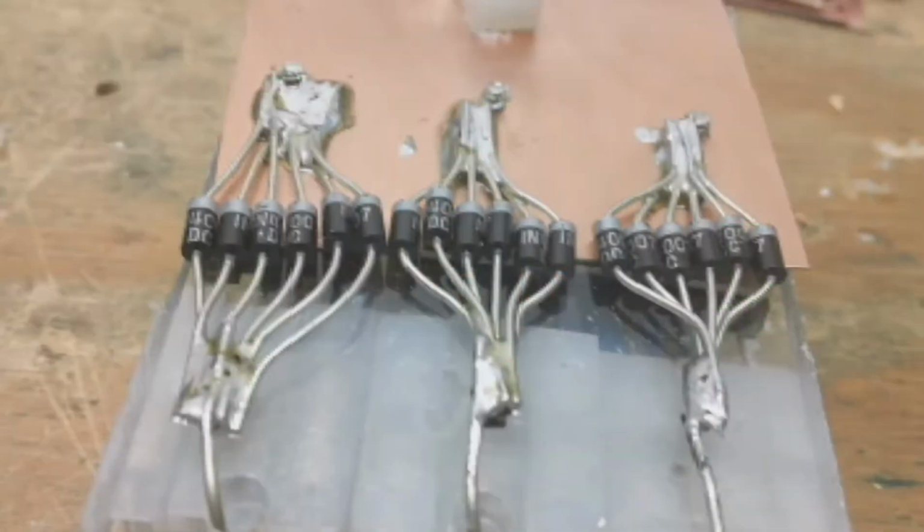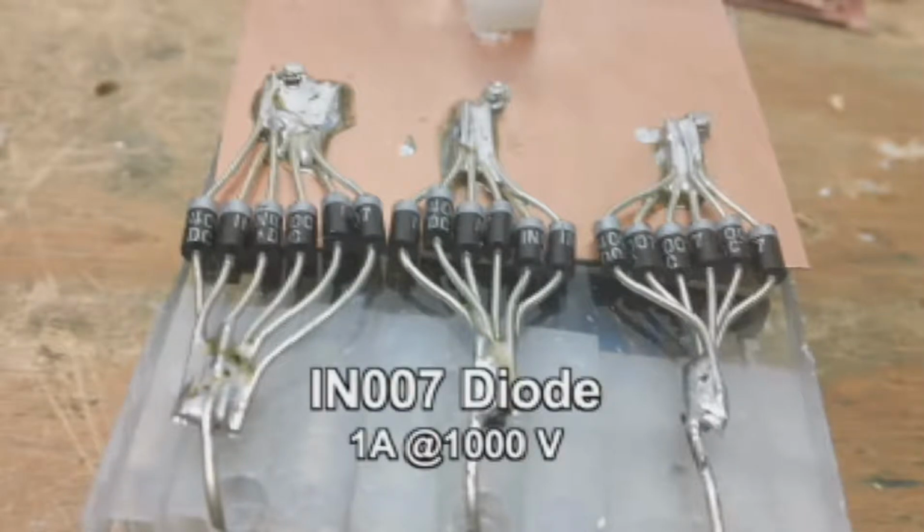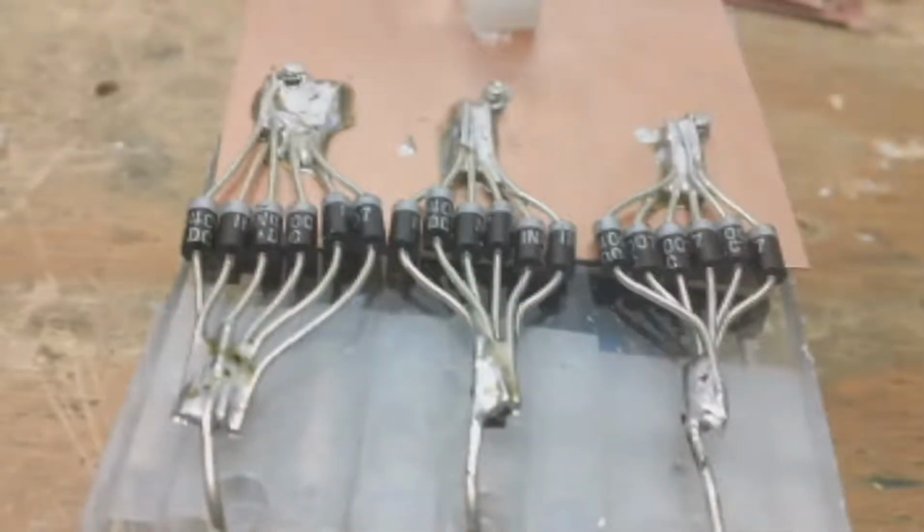Talk about the back of the control board. These are 1N4007 diodes. They're rated at 1 amp, 1,000 volts. You're running 6 of these in parallel, which means this circuit right here for each wire, because there's 3 power wires in the coil, can handle 6 amps at 1,000 volts. Now, we're not getting anywhere near that, but we are getting a transient spike from the pulse collapse.